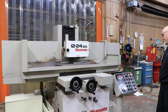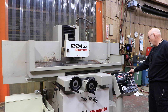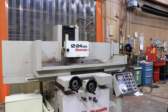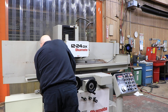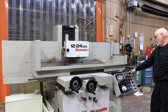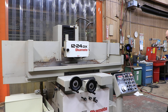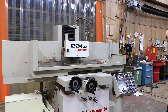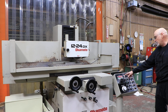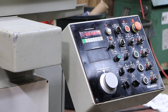Got to put it in auto mode. We'll just watch it go down once or twice. So once it gets to its reversal point on the magnet, this will feed down. Fed down one thousandths to two. I can shorten up my little dogs over here so it goes quicker. Then we're going to feed down to one thousandths. I have it set here where you start feeding at five tenths before zero, which is why it only went half a thousandths. Now we're going to go one tenth each pass — so we went from five to four, four to three.